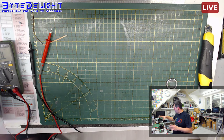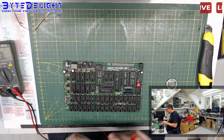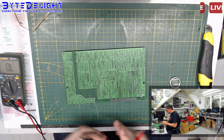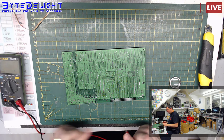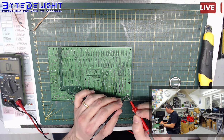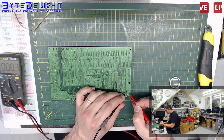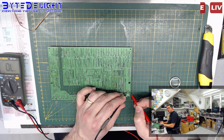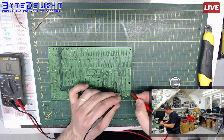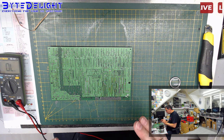So we're back here, and you just noticed that there wasn't any 5 volts. The die card didn't show any 5 volts. Of course, the first thing that you do is check if there's any short. You put it on continuity mode. I'm not sure what the best word is. So I'm just measuring ground to ground. That should beep, but there shouldn't be any connection between ground and, for example, 5 volt output, or ground and 9 volt. So nothing between those. So there's no static short.